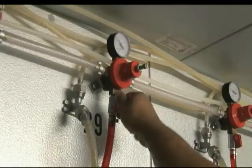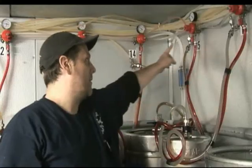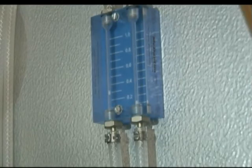When your ball is floating near the top, you can have someone help you or do it by yourself — actually go around and turn off the shutoffs on each of the regulators and watch the ball until it drops. At that point, you know you've isolated the leak.